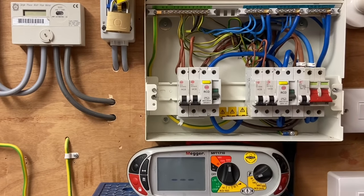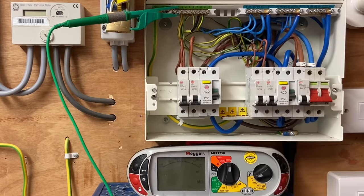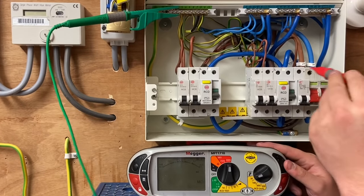On this installation we can clearly see all loads have been removed — we have a small test rig. If we had a bigger installation, we might find it necessary to do it at 250 volts first, just to make sure we have actually eliminated all sensitive electronic equipment from the circuit. Marcus is going into the earth bar first and will work across the circuit breakers in sequence.